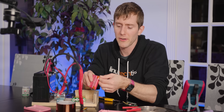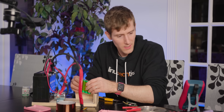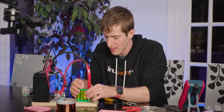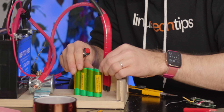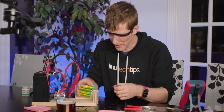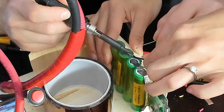The original battery had extra length on these two strips to solder to. Removing these is not going to be easy — basically, you can't. We have a couple of different approaches: we can either solder directly to this strip right here, which is probably fine except that it's going to heat up the battery, which is not what we intended. Or we can try to spot weld another nickel strip on top of the original one. We vote for spot welding. Now we've got tabs on the end for soldering. Now all we need to do is solder the electronics to the original pack, fold these tabs down, make sure they're still on there, and we can solder the pack back on.